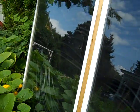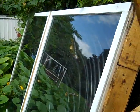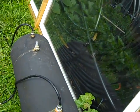This is my solar water heater — I'm very happy with it, I built it myself. It stands six feet tall and it's ten feet wide. A friend of mine gave me the windows, which are two double-pane glass store windows — very large, very heavy. Inside there's 400 feet of three-quarter inch black hose coiled up.